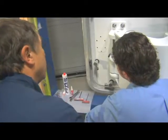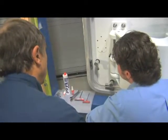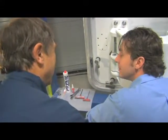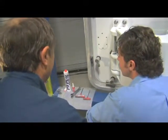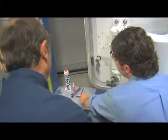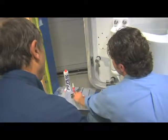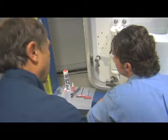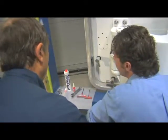Tim explained that making these adjustments on this door requires some simple tools — it doesn't get much simpler than a hex head and a couple of open-end wrenches. For this one we just need a 3/32 Allen wrench, a 3/16 Allen wrench, and two half-inch box wrenches. That should be all you need.